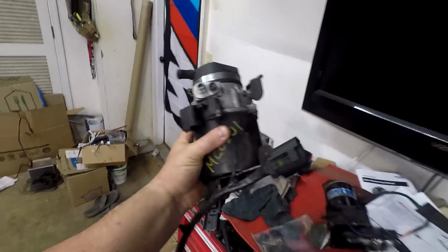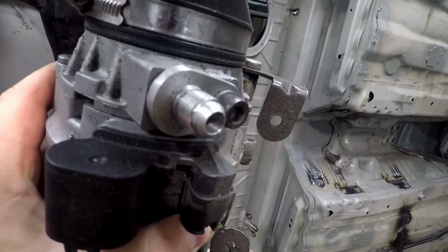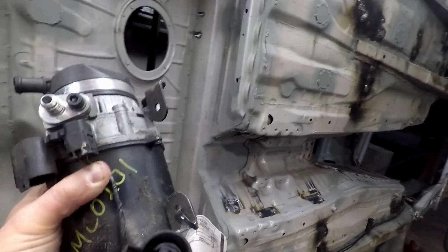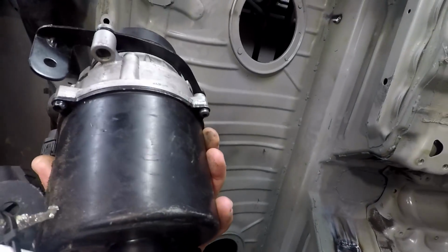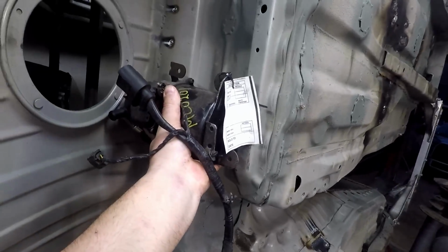And then I'm really excited about this. This is the power steering pump. It's from a Mini Cooper, and it's a full pump. I had this fitting here made especially for it to convert it to -6. But this I'm going to mount, you know, wherever I don't mount the water pump. So somewhere around here. Both of these pumps are really heavy. In fact, this one's probably twice the weight of the water pump. But I'm going to kind of make it sit in there like that.